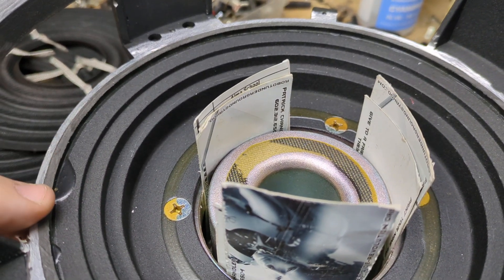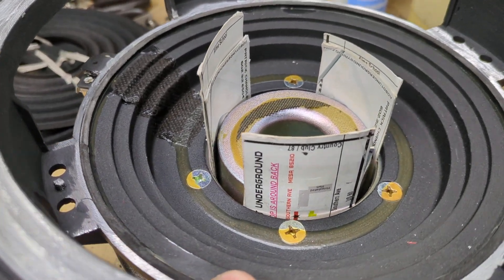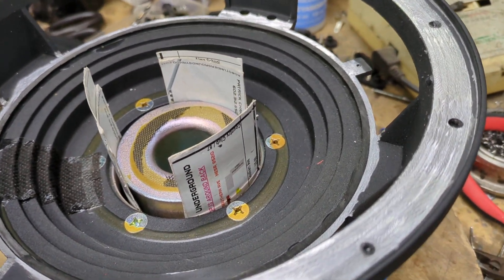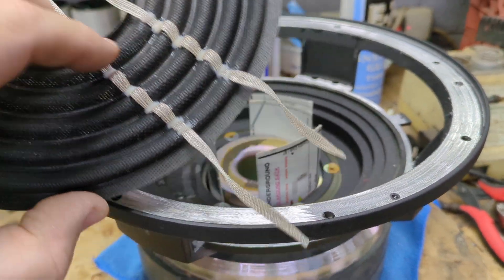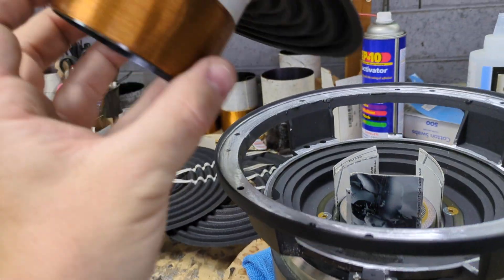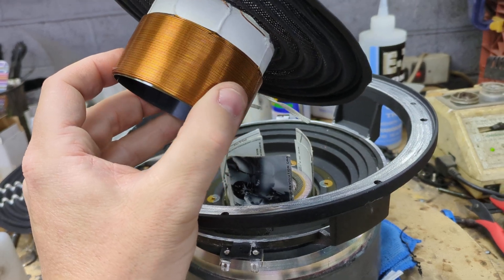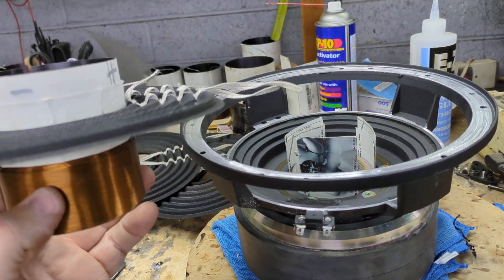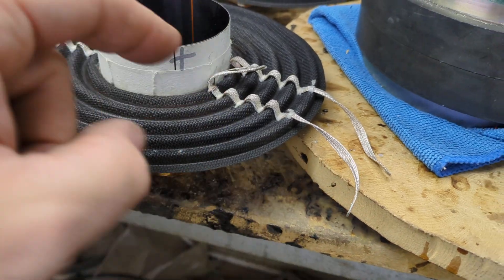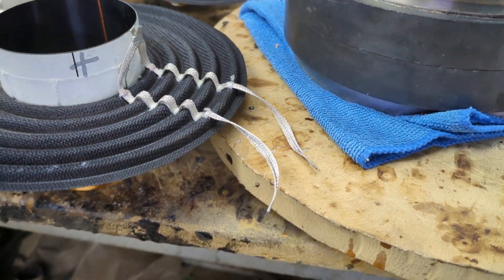Because they wanted to sit on the eight-inch landing, they added a little spacer that just gives it a little more glue surface. I ground that flat — it's made of what looks like paper, so it's better than nothing. I had to trim up our typical spider a little bit on the outer diameter, then using the Concept quad coil, which is all-copper quad one-ohm, and I wire all the coils in series for a four-ohm load. Each terminal — positive ends up being on the right because of the way the coils all wire — I already soldered and terminated to that side.